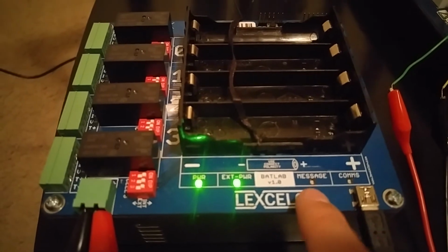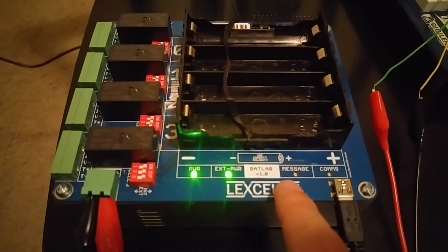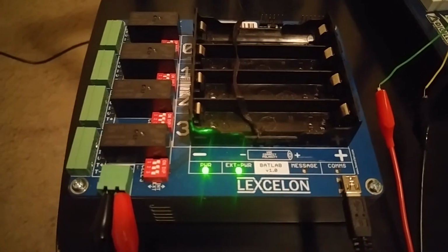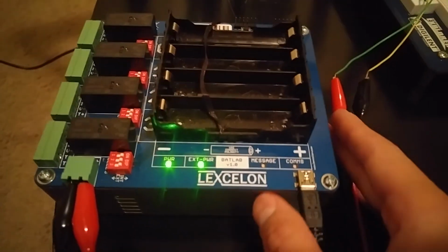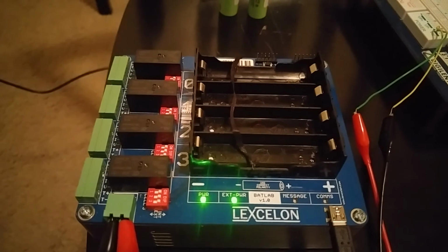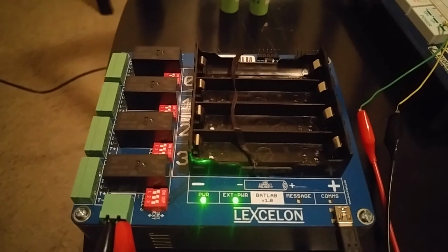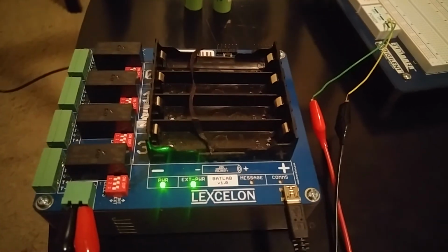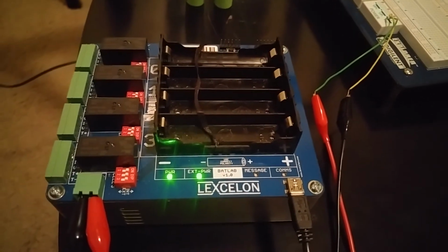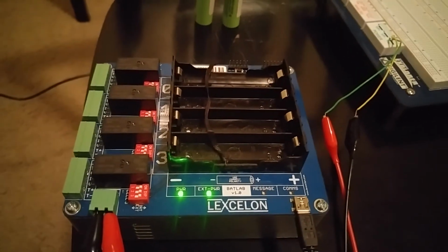The message LED here is used to indicate which unit, for multiple. So if you have multiple Batlabs, this LED is used to communicate which Batlab should be populated with cells at any given time. So the software, once it is polished and the graphical user interface is ready, would be capable of walking users through the whole test process, from providing a cell naming scheme to prompting users, based off those cell names, to put them into their Batlab units and alert them when that cell is completed testing, etc. And this LED can be used with different blink patterns just to indicate to users, hey, this is the Batlab you need to be populating at this point in time.